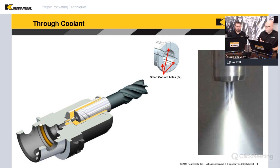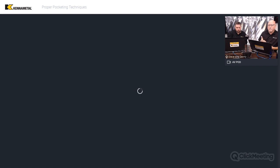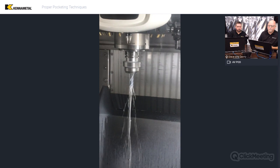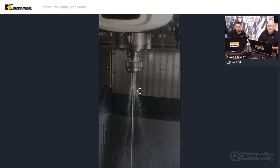We have a video of our Core 5 that shows both the internal coolant through the tool itself, as well as the coolant from the nozzle. Before the video even starts, you can see the main stream — coolant coming through the center of the end mill. Then when the coolant is fully turned on, you see a wall of coolant surrounding the outside. That will blast out the chips, doing a really good job in these pockets to prevent chip recutting.